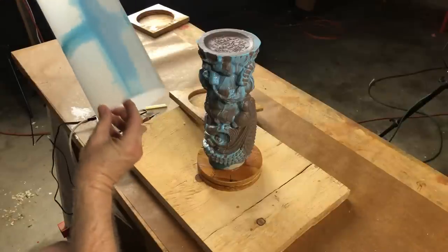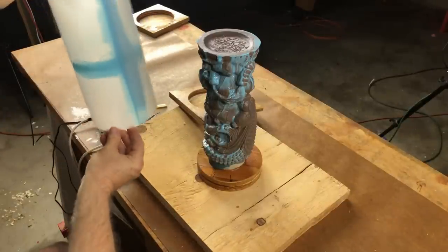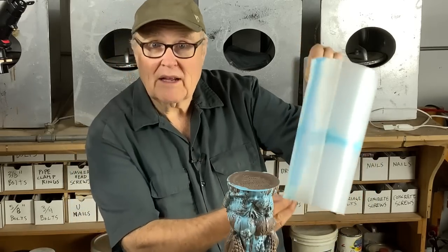Time to build a case. I took my beautiful welded-together gallon jug case and sealed it up on the inside with the same rubber I'm going to pour with — I did that yesterday when I did all the pre-painting — and that means we're not going to have any leaks. Best tip in the world: if you use the same rubber to seal the case up, sealing all the edges and seams ahead of time before you pour the main mold, you won't have any leaks. It all just becomes one mold. It took me a few years to learn that little trick.